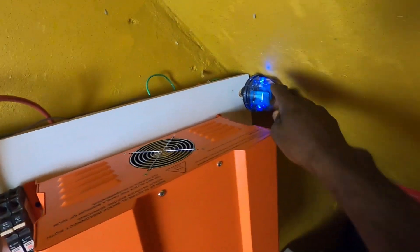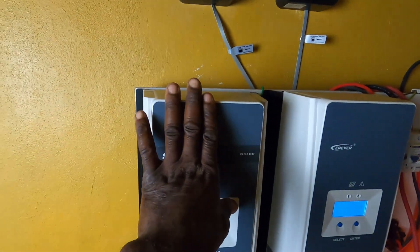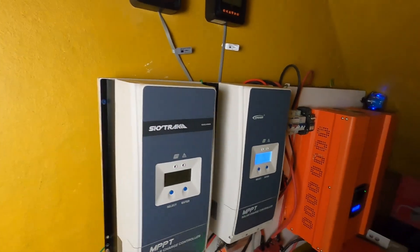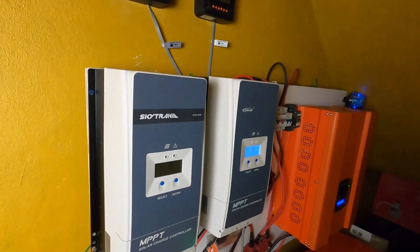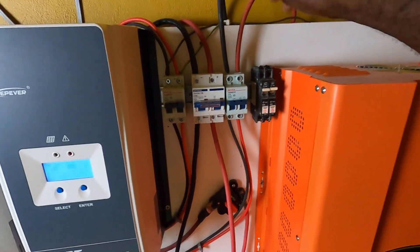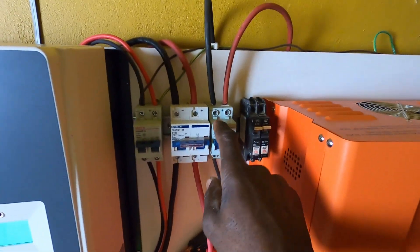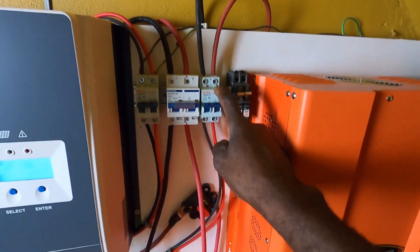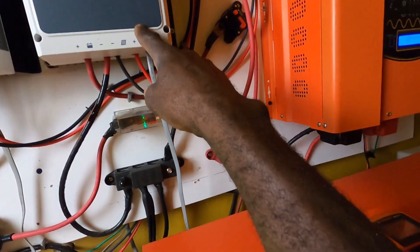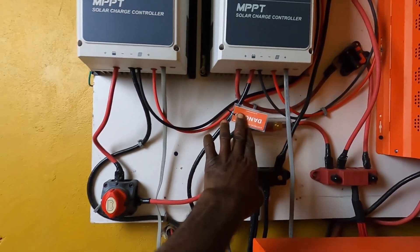I'm not yet complete with the system. I have a lightning protector for the original charge controller, but it still doesn't protect the new one yet — which just goes to show you can start somewhere and improve as you go along. These are the wires coming in from the three panels up top, and I bring them through this breaker, then down to the charge controller.